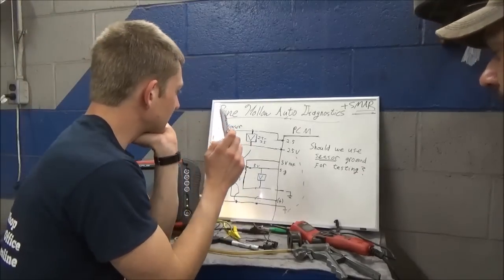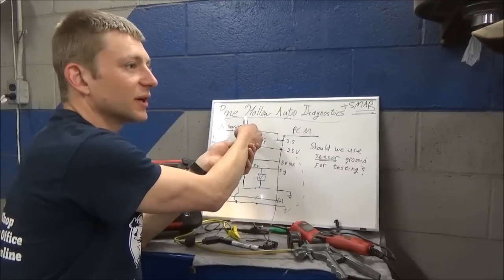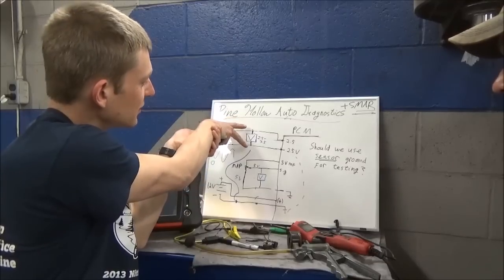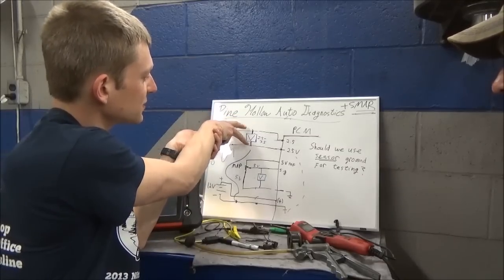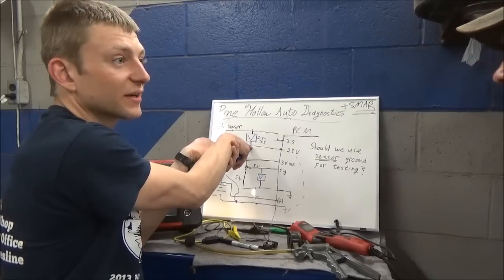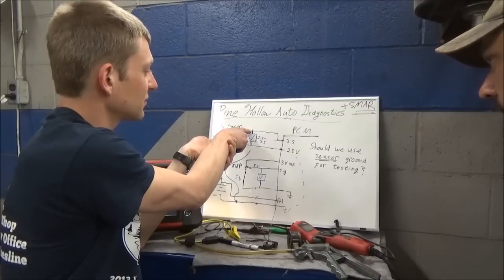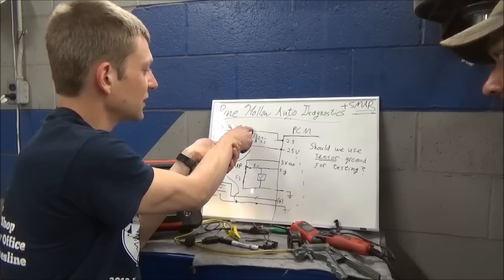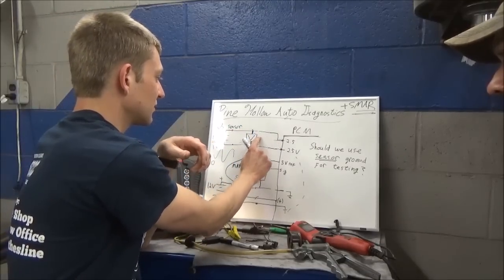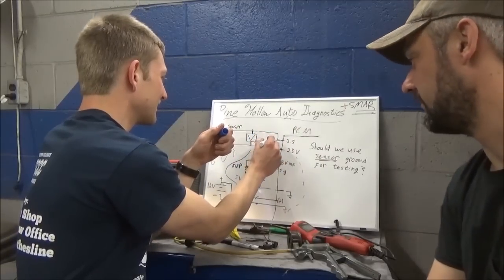You can check by measuring what's the difference between these two wires. The voltmeter all it does is measure a difference - you can't say this is ground. If the negative is hooked to two and a half volts, and signal goes from 2.5 to 3.5, the voltmeter will actually display zero to one. It's measuring differentially - so if you measured it this way, you wouldn't even know you had a bias voltage.